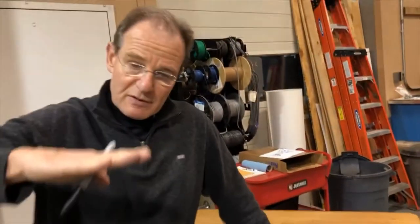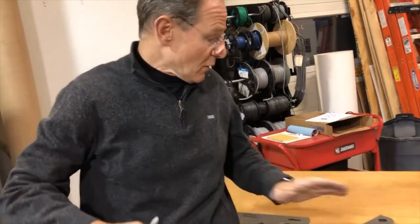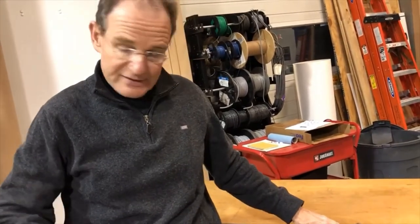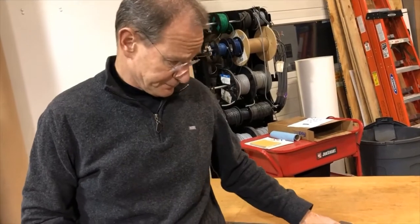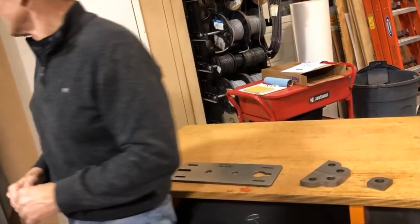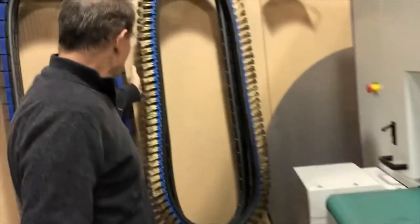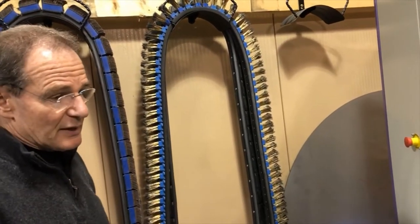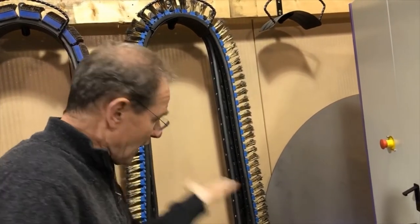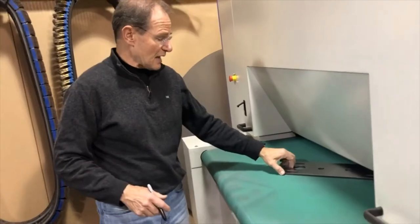When you use a wire brush for oxide removal — if you go around with one — you can remove oxide, but not on a small part like this. The oxide brush will put a lot of lateral force on the part and will move it, even though there is high friction from the conveyor. So the wire brush approach is not suitable for small parts.